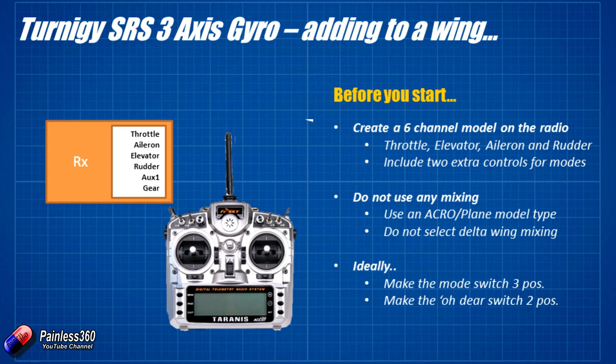One additional channel is going to select the mode switch — choosing beginner, practice, promotion, expert, or off. You can change which modes you want on the fly by flicking a switch. There's also another channel which is the emergency switch. What the emergency switch does is level the craft out and put the elevators up slightly very briefly, so if you were in trouble it tries to pull out of a dive and get it flat for you. That's why I wanted to put this in a wing — it's very handy for the person I'm making it for as a gift.